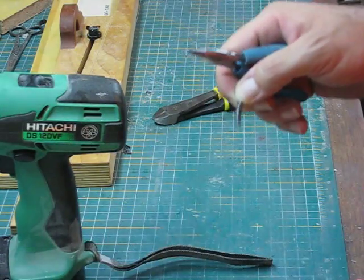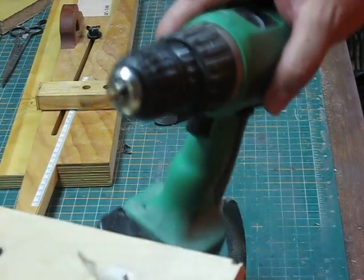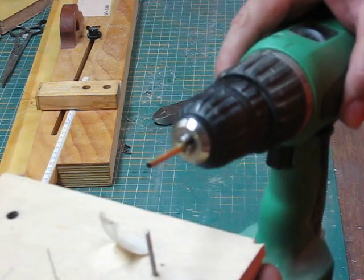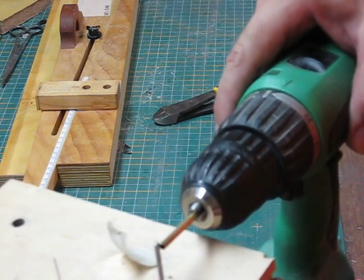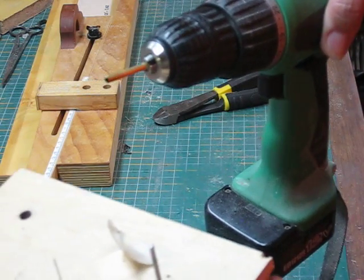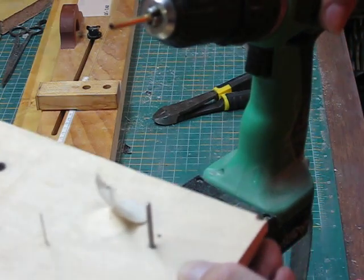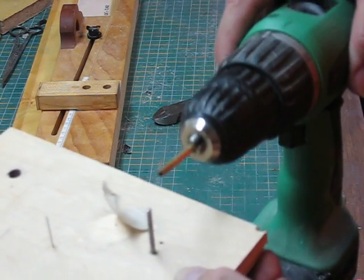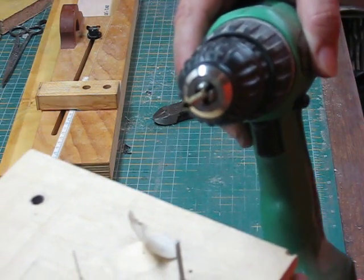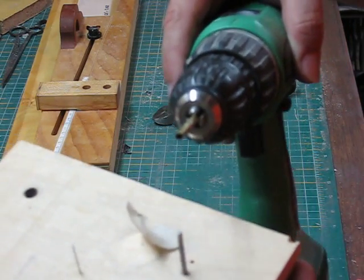Nice little spring. One thing that's important I forgot to mention, the reason I use this size mandrel and this size tube is there's just enough clearance inside here for the wire. For the OD, this is a 0.109 inch mandrel plus the 009 wire times 2 gives me about a 127 OD that fits right into the ID of this piece of 5/32 inch tubing and keeps everything nice and tight. You've got to keep it tight or it will unwind itself right on the inside.